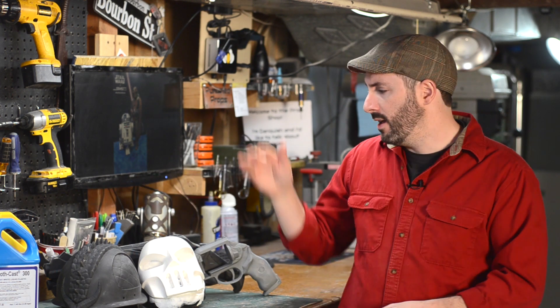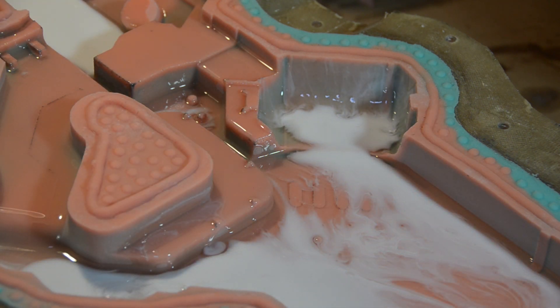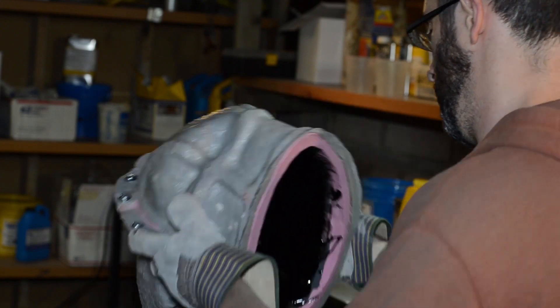Most of the time I'm casting stuff in the more rigid plastic variety, like if I were to make a space gun. Here are a couple of examples that we like to use here at Punished Props. The first one is Smooth-Cast 300 — very middle of the road, very general purpose resin. It's really handy and useful for just about all the applications you could think of. So if you're going to jump into this, that's a great place to start. Smooth-Cast 65D is also similar to 300 — they're both white, they cure totally white. But the 65D has a higher viscosity, so it sticks well to surfaces if you're going to do any rotocasting, which we will cover in a future video coming up soon.